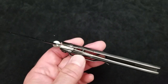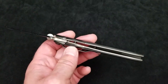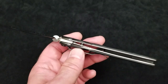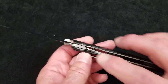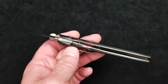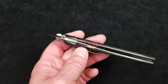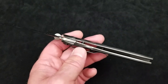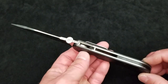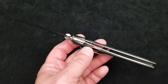There is at least, even with beta titanium, which has a very high hardness capability for titanium, still more than a 10-point spread just to get up to your common blade steels, things that we think are entry-level, like your 440C, your AUS-8, your 8CR, steels like that, that are just the beginnings of high-carbon stainless steels. There's still a huge difference.